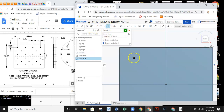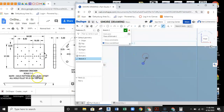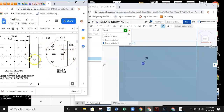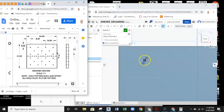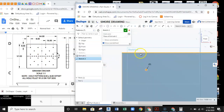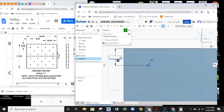I'll use the array tool to position the holes. I grab the circle tool and rough in a circle, then add a dimension. The note says all hole fillets are radius 1, and looking at the detail view drawing — which is scaled 4:1 — the hole diameter is 1 millimeter. Now I can start positioning: the hole pattern is 8 by 8 offset, so I place each hole on an 8 by 8 pattern.